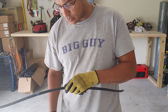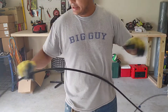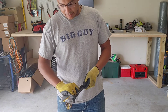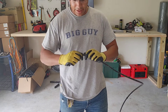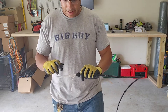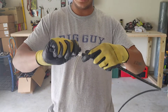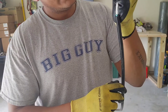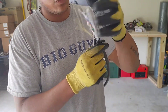Now I'm not cutting into it — I just want to mark it, sort of scoring it to know where I'm going to go. I'm going to come back here and get just a little bit off the top, enough to where we can expose the strings. It's okay if you ream a little hard right there because you usually cut that off anyway. What I did was I pinched right here and right here and just rotated — there's no twisting. You're just rotating it to where you're breaking the armor off. We have the cable jacket and then we have the armor. You want to make sure you get through the armor so it's going to slide off well.